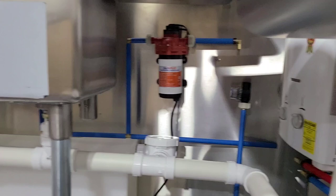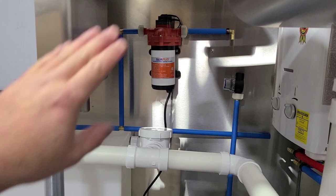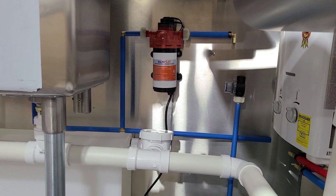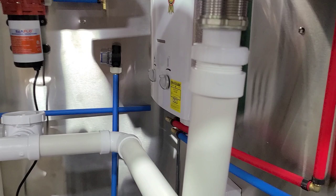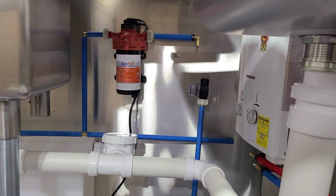One of the mistakes I made when building my first food truck was putting everything in place and then trying to crimp it where it was. Getting that crimp tool into little corners and crevices is really tough. That's why we take it out and crimp it outside — so much easier and you get a really good connection. The cold water goes from the water pump down to the T and into the three-compartment faucet, and the hot water goes with another elbow into the water heater. Questions? Let me know.